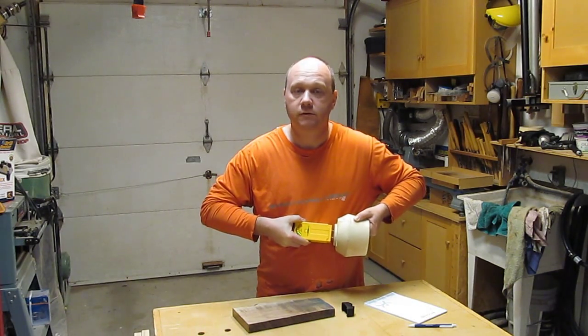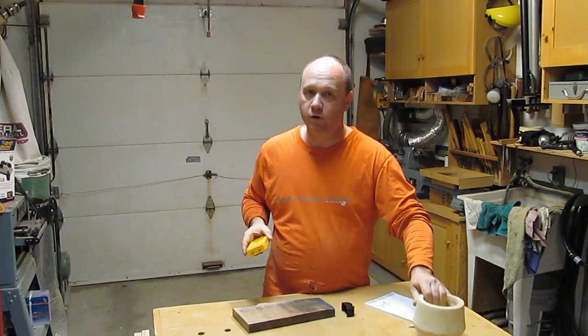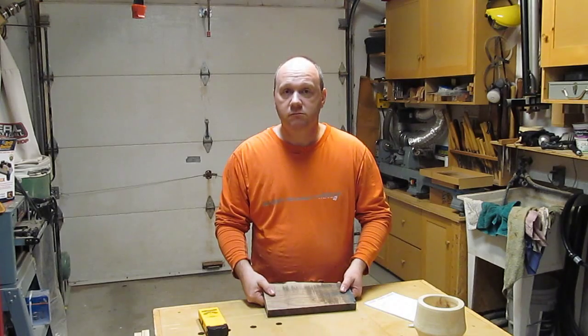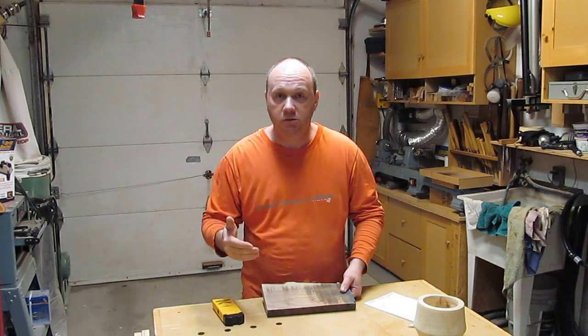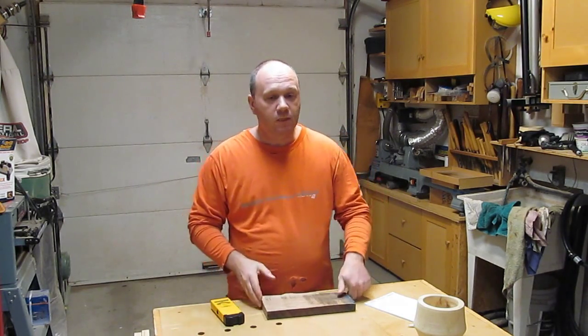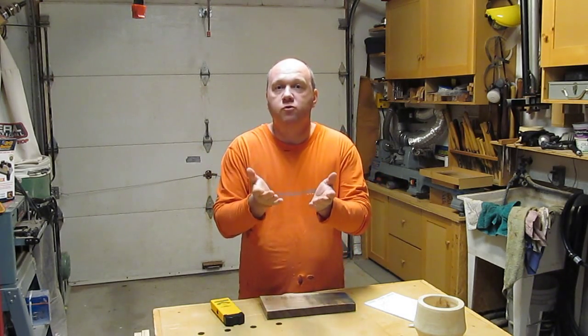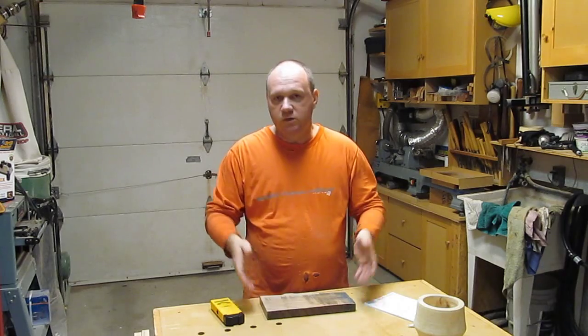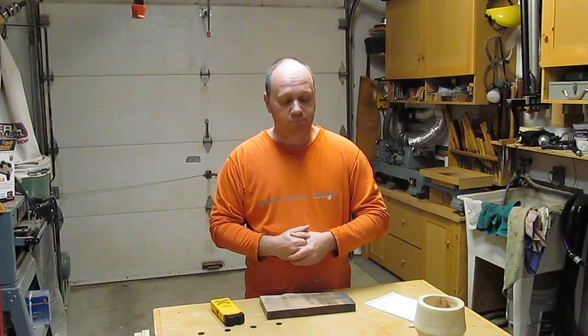It's at 14%, which means this piece is not dry enough to work on. Make sure to try to have the humidity around 8%; if it's higher than that, there could be problems when it retracts as it dries — that could explain some problems you have. I hope you appreciate it, thank you.